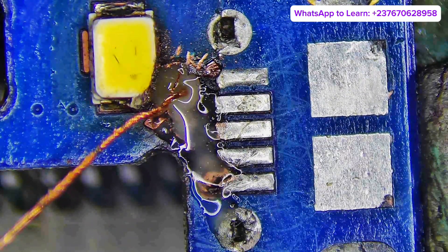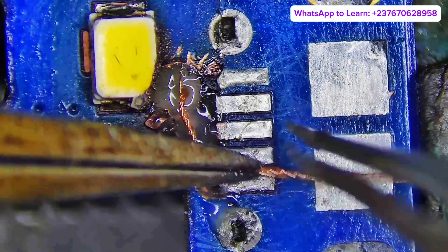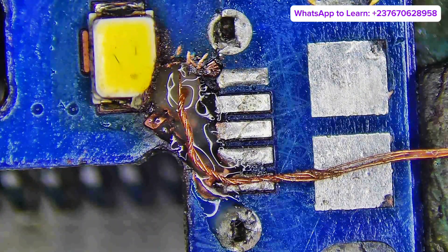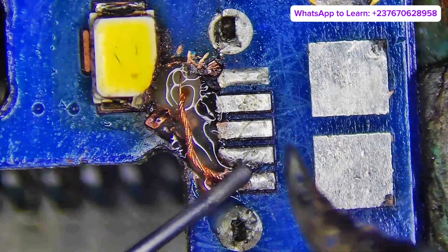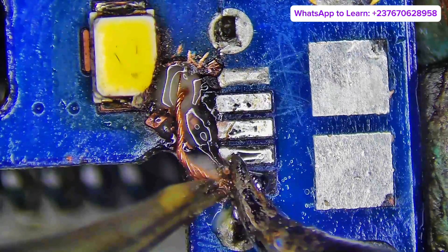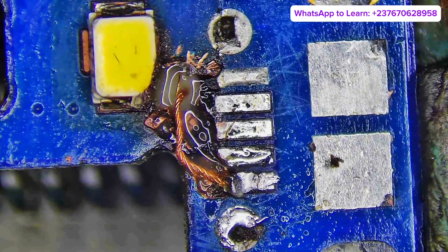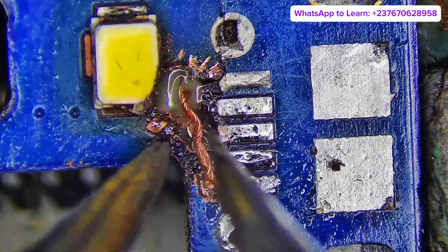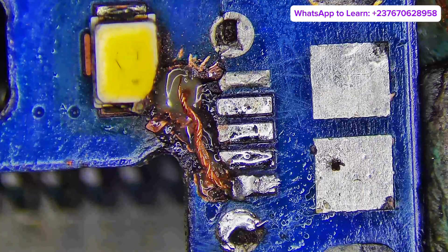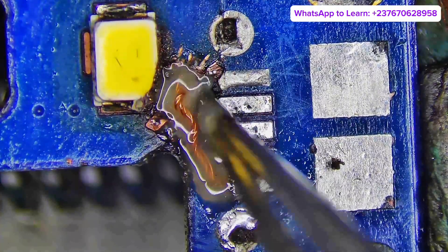I think that's very important in such a way that it won't come back. We have to connect it — it's the V-Bus — so we have to connect it to this other line in the battery connector. We just have to connect it right there, cut it off, solder it, and then push it backwards again, because the pins of the charging connector itself need to fit right there. So we adjust everything and glue it, making sure it doesn't contact the other layers. That's why I do not press the wire down.